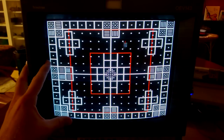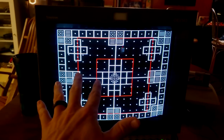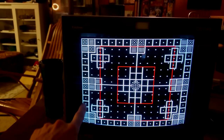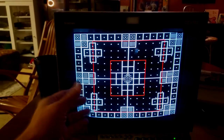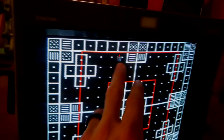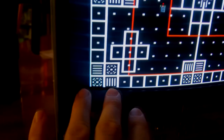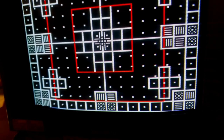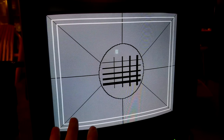On the monoscope pattern, we don't see much issue. It's not great — the centering isn't perfect. We may even have a slight bit of crookedness along the sides that hopefully can be corrected with just an hour spent running through the geometry menu settings and making adjustments. The convergence is actually really nice in all areas of the screen, meaning I don't see a lot of color separation. Normally you might see that at the edges and corners — a separation of your red, green, and blue.